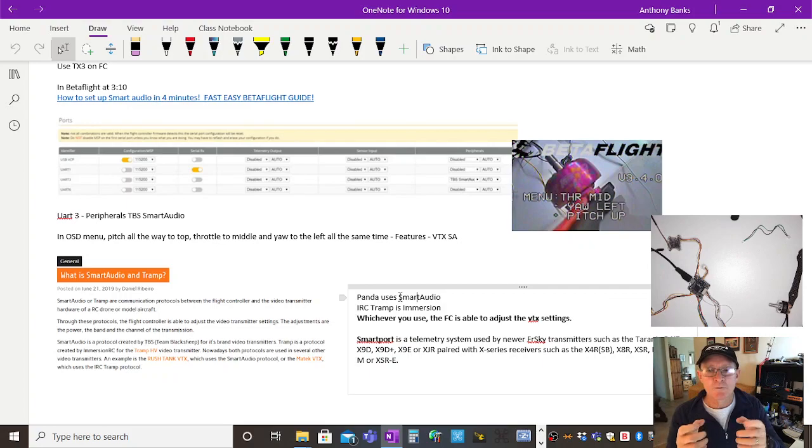You can sit there with your goggles on and move the gimbals in a certain way, and you can change it. I do this for my drones. You can actually bring up a menu and change the frequency and the power output. If I'm just flying really close to myself, doing some slow flying around trees with my video goggles on, I just want to use 25 milliwatts. It's hardly any power. I'm not disturbing anyone. 25 milliwatts, ACMA class license, etc.